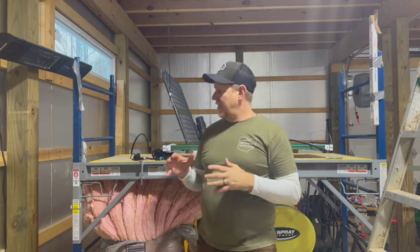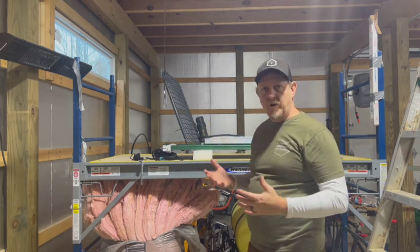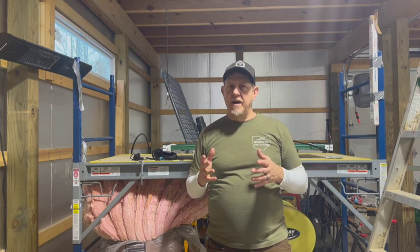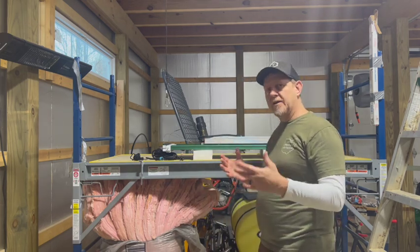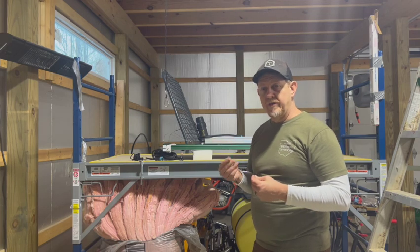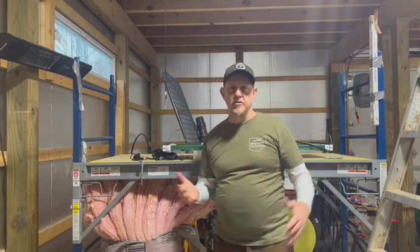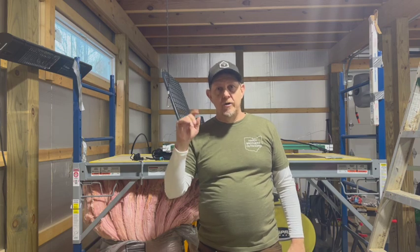I'm not an expert in LED lights, but what I can tell — very nice setup. The top has venting to allow the heat to dissipate, and it says you don't require any fans or cooling to augment this light. It's going to stay nice and cool and not overheat your room. I want to say it's 55,000 hours of life on the LEDs. Certain types of lights like metal halides degrade over time and you lose your spectrum — the kelvins being given off. But because each of these LEDs is set separately to those different settings, you shouldn't have that problem. So we'll go ahead and finish hooking this up and show you it plugged in.